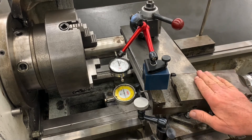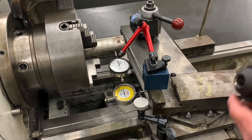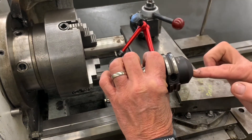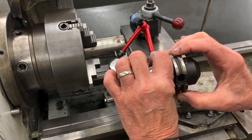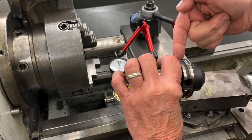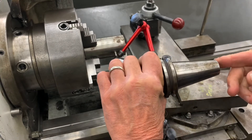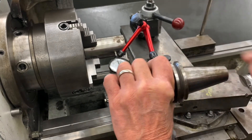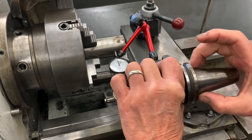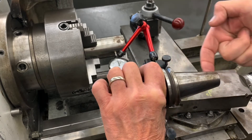This is how we're going to set the machine up to cut the CAT 40 taper on our CAT 40 tool holder. We're going to machine everything on this end first — machine this diameter at two and a half inches, put the 45 on it, and we've got a tool to cut that groove in there. Then we'll flip it around and hold it by the nose, preferably in a four-jaw chuck so we can keep everything true and indicate off it. Then we'll come back, turn this diameter, set it up for the taper, and cut that taper with the tool on the back side.